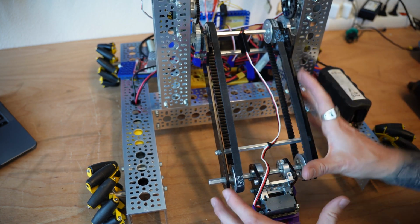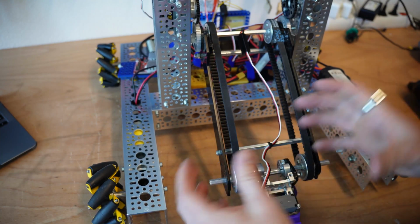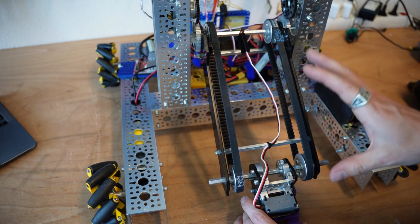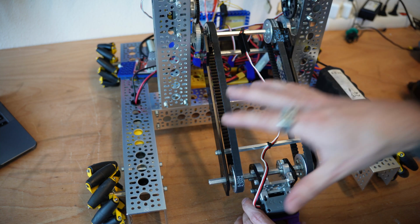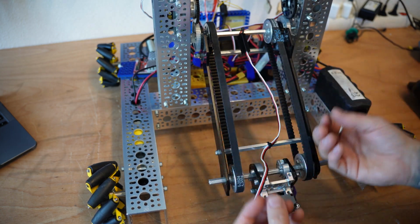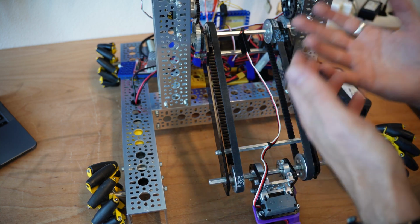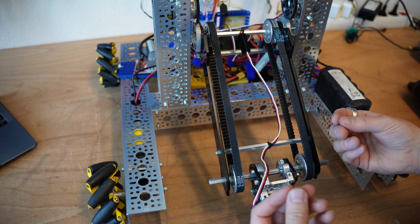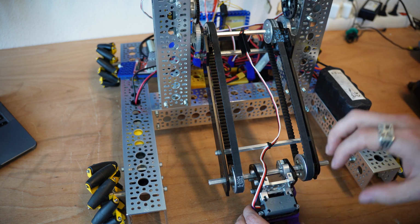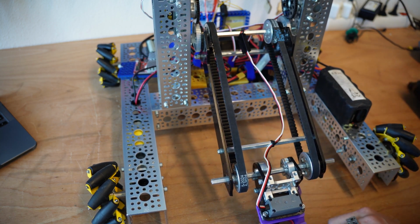Being able to understand those different lifting mechanisms, the 2-bar, traditional 4-bar, and virtual 4-bar, gives you more options when you're designing your robot. Each of them has their own place. It's not like the 2-bar, 4-bar, or virtual 4-bar are good or bad. They have their purposes. So the virtual 4-bar with a pulley drive or a sprocket and chain is a fantastic choice for lots of applications where you need to keep that end effector parallel to the ground. As well, it's also fantastic when you want to keep things nice and light.